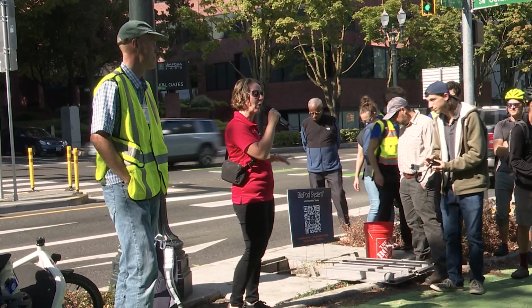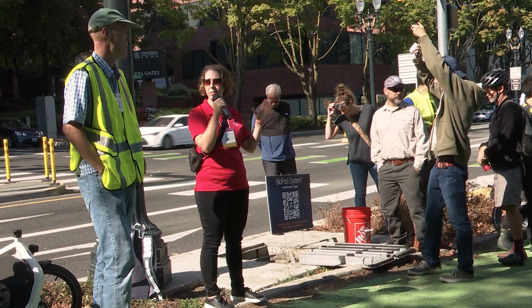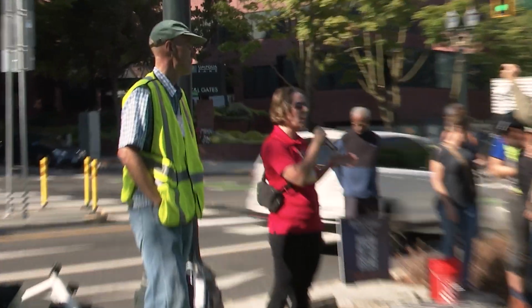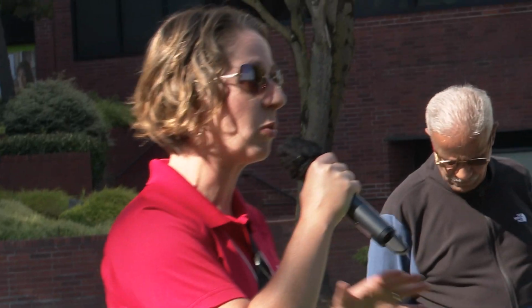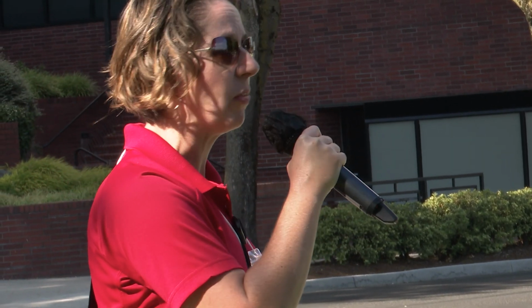Yeah. So this particular unit was maintained like a week ago. So it was maintained very recently. And these units had not been maintained since they were installed. They did receive a lot of very oil-laden runoff when they put the asphalt down on the street. So it received all of that runoff. It was accumulating probably 4 inches of sediment on top of the mulch. So removing that sediment and the mulch layer was what was done on this particular unit, and then fresh mulch was applied.